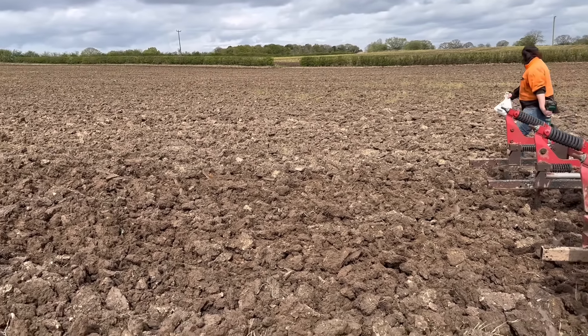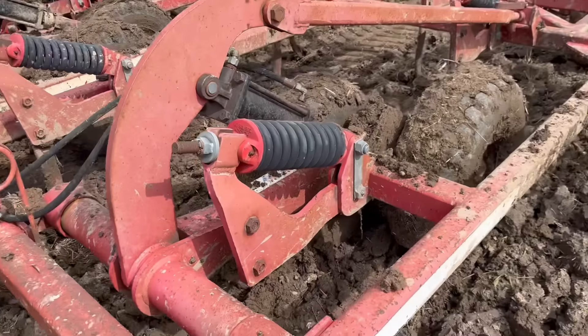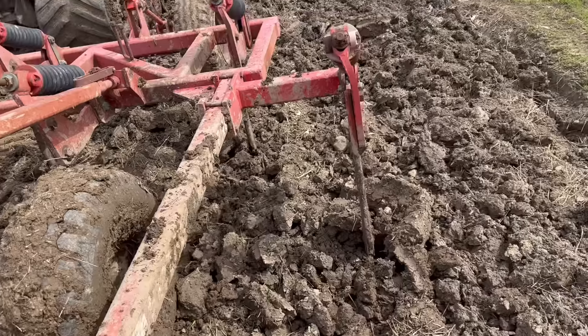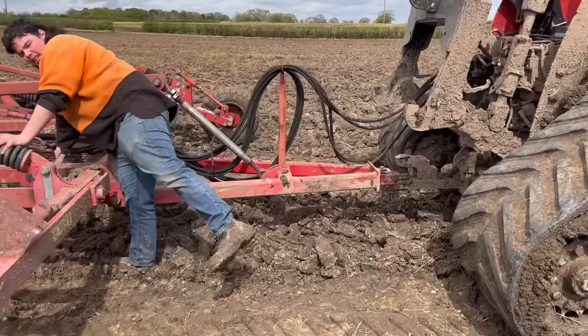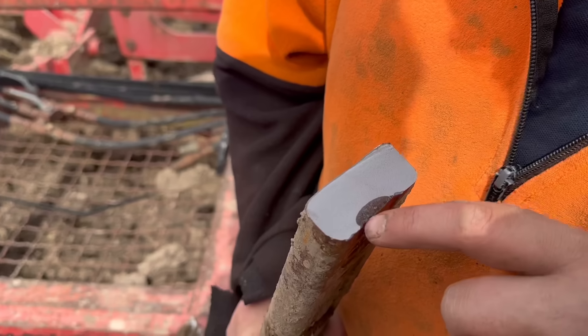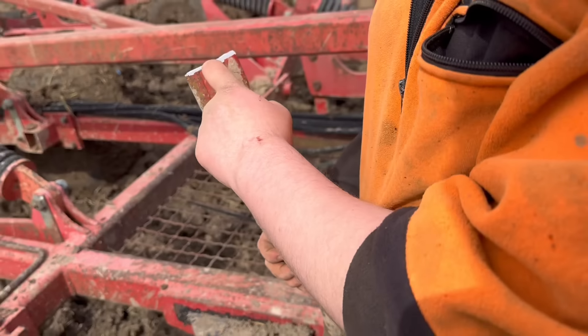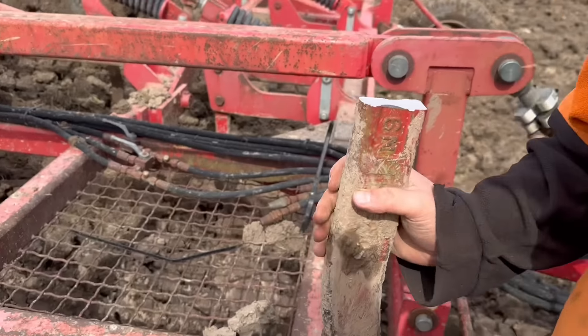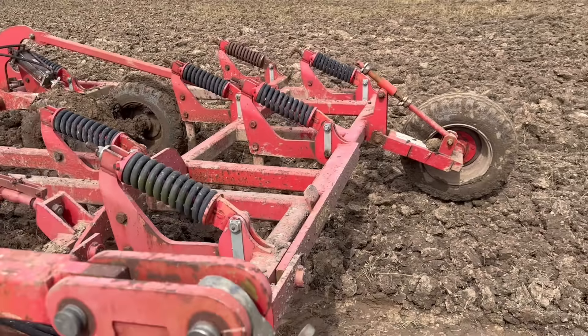This field that we did yesterday has dried up lovely. We're going to call it a day now - John's just finished as well. We've got this leg that's snapped, which is a bit random behind the wheels - but it was already half snapped. If you look at where they stamped the number there, it's like putting an inclusion in the steel, making it a bit weaker. If we join both parts back together I'm sure we'll get the full part number - we'll try and get a number off machine number one. We'll have to order one. If we can't get one when we need it, we'll just unbolt that one and stick it on there. We'll narrow it off a little bit. It is drying up well, it's just a shame we can't move on the other fields - but we've done that one anyway.